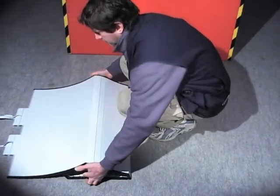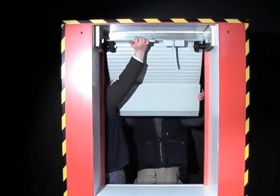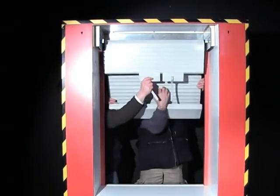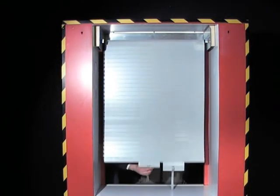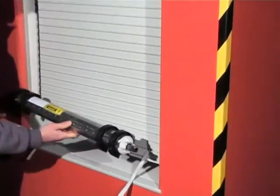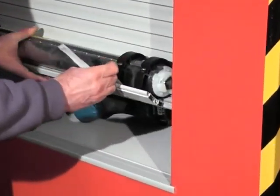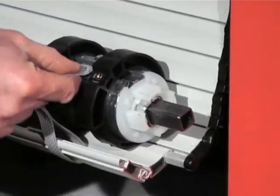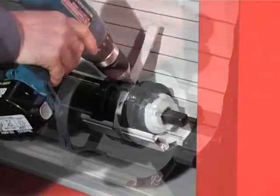You are now able to install the shutter in your compartment. We advise you to prepare your shutter as displayed on the screen, taking care to let a large part of the top shutter lap overlap. Next, slide the whole shutter starting with the top against the wheel, until the last slat jams against your header. At this point, you are in the right position to assemble the shutter to its roller. Take the roller and fix it to the shutter with the aid of the tube fastenings, taking care to check the direction of the assembly.